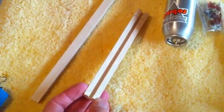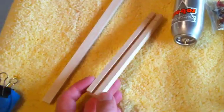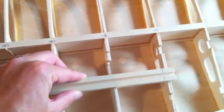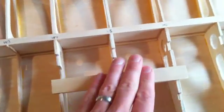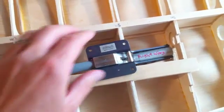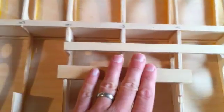Right now we need to focus on building the mounting section in the wing using a plywood brace, landing gear brace, and a basswood brace. This has a groove in it — it doesn't really serve any purpose for the retract install, but for fixed gear the holes are drilled in this groove. For this purpose we're going to install this brace in a downward position, placing the mounting plate for the retract on here, drilling holes into it, and we don't want that groove interfering.